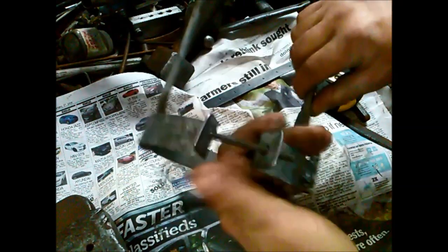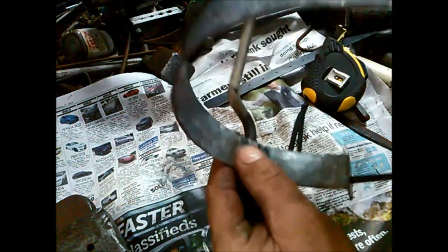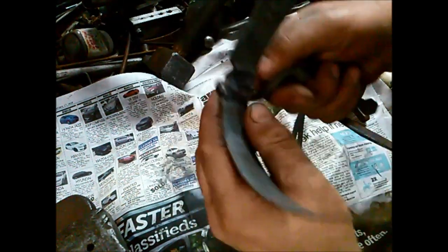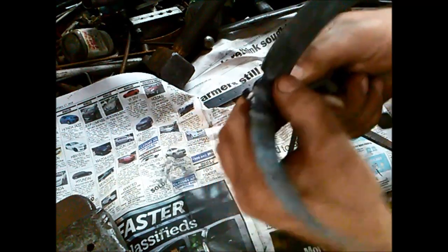I've migged it up. I probably should have got just normal mild steel — galvanised is a real pain to weld, it splatters everywhere. I've also got to just grind those weld-through marks as well, a little bit.